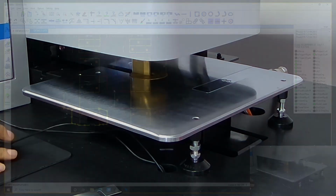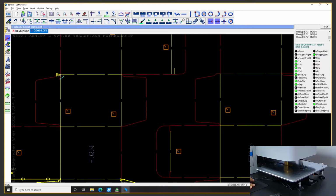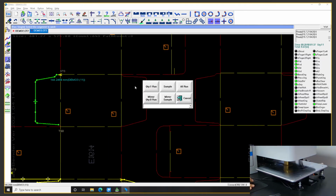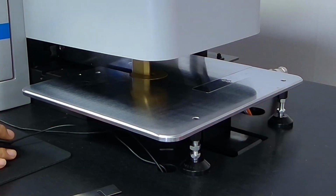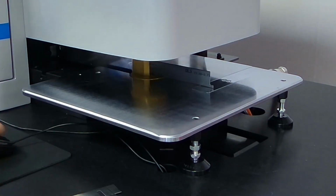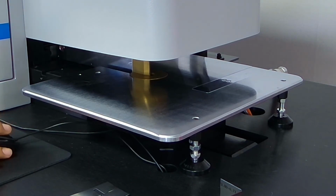And now we just want to point out and highlight another updated feature, which is the overall speed of this machine, along with this postcut function. Our conventional EasyBenders have always been a cut first and bend later mechanism, and depending on the shape and type of file that you process, sometimes it'll actually change the geometry of the pieces a little bit if the machine is not really well calibrated. So we are fully aware that customers are not engineers. Sometimes they have no clue how to fix those issues, and they don't know what to do with those things.